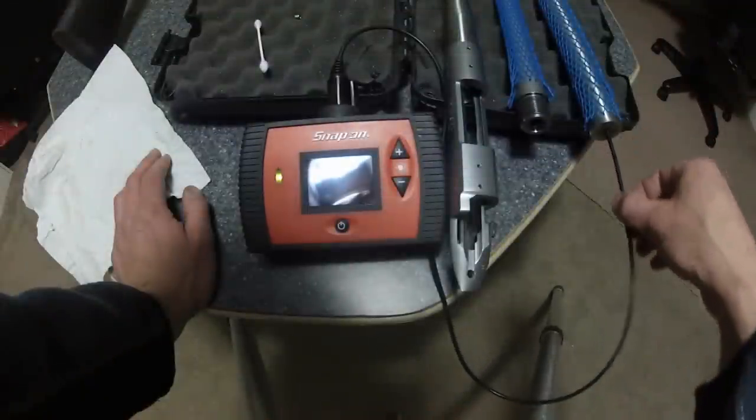Compare that to my old barrel. Here's the neck of the chamber, then the land of the rifling. And this is the rifling — you can see the groove marks. There's definitely some erosion, and you can see pitting.